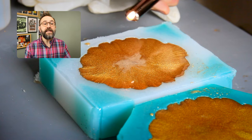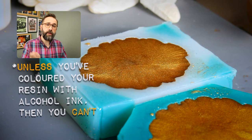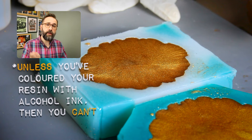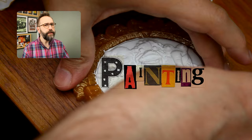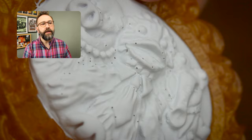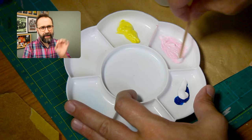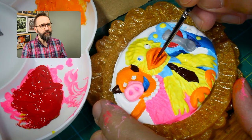It's a rite of passage we all go through. And then these are those two moulds that I poured. You can use a flame - either a little chef's blowtorch or just a gas lighter - to pop the bubbles as they arise. For about the first 15 minutes, just pop back every five minutes and pop your bubbles. Masking tape off. Once you prime it, you do see the bubbles, but it's okay - a quite thick layer of decent quality white acrylic paint just worked as a filler. So that amount of bubbles was fine.